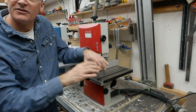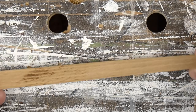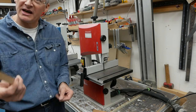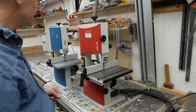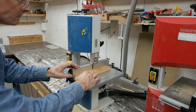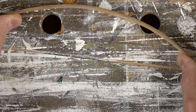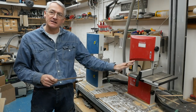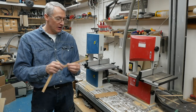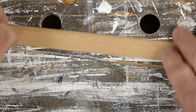That fence does inspire confidence. That is really a very nice, very good, clean cut. Just out of interest, let's see how the 80 quid Aldi with a six-month-old blade does. The Aldi bandsaw does remarkably well considering it's on a six-month-old blade, but definitely the sturdiness of the fence and table won through for the Axminster — getting a strip of around about a millimetre thin all the way along, whereas the best the Aldi could do at the moment is about a millimetre and a half, sixteenth of an inch or so — but still not bad.